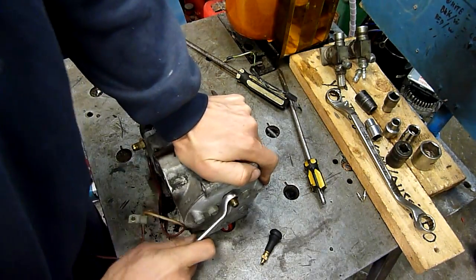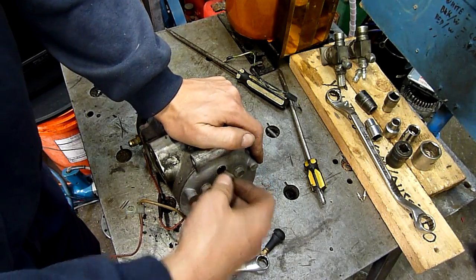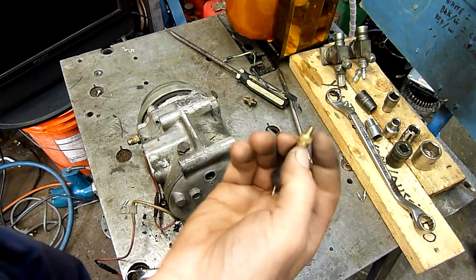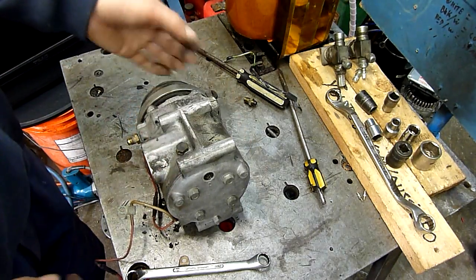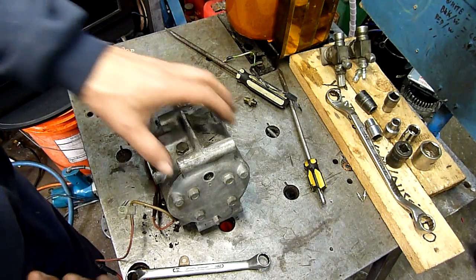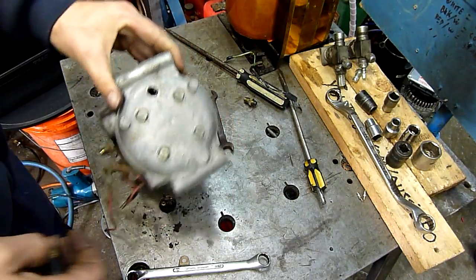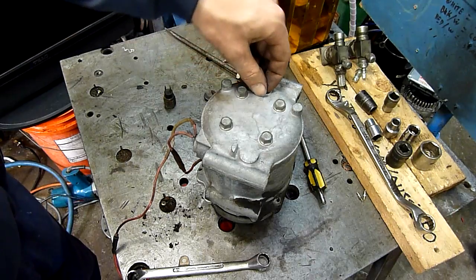They're great for car tyres, but schrader valves don't run that hot, and very rarely does one go bad and start leaking — but it typically happens after you just use it. I've had it happen before: put air in a tyre and the schrader valve won't stop leaking. You just screw the cap on tight, drive home, spin it out with a valve tool, stuff a new one in and top the tyre up again — no problem. In a refrigerant system it's another matter, because you're releasing gas to atmosphere and you've got to connect up a recharge bottle and add more gas to the system. So leaking schraders on a refrigerant system are a pain in the arse.